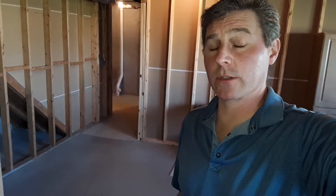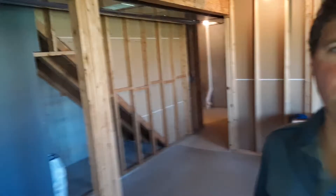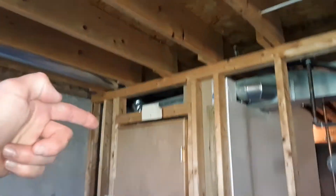It's John here with the SPECFLIX, and in this video we're going to talk about general framing on stick-built structures, and in particular load-bearing walls. Right now I'm in a basement that has a load-bearing wall, and if you notice, the floor joists that go from side to side have to rest on an internal wall, which is referred to as a load-bearing wall.